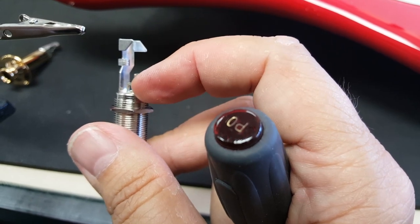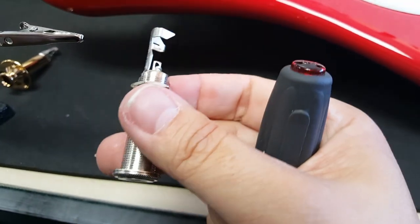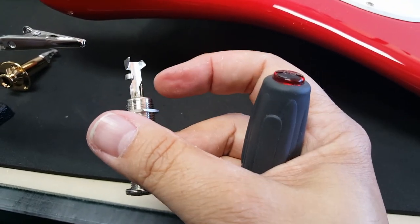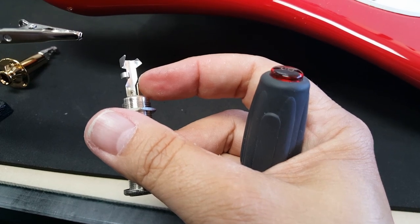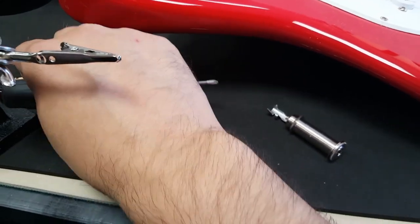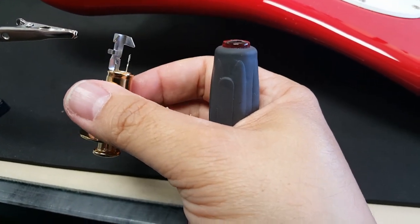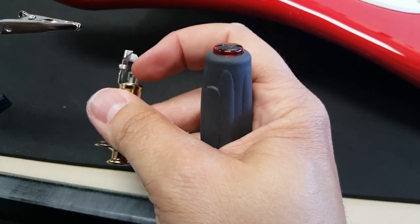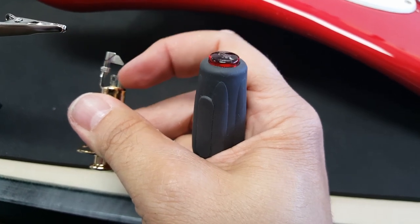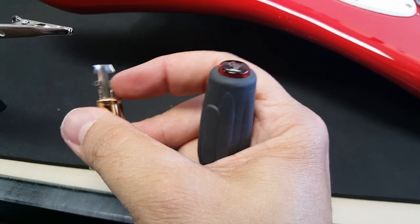The shortest one — that one right there — will be hot. So there's your hot and your ground. If you were installing this in your acoustic or electric guitar, you'd be done. If you had a 9-volt battery, you would attach that 9-volt ground to the third terminal, which is in between the longest and the shortest. What about one like this? This one's definitely for an acoustic guitar, but same thing. The tallest one is the ground and the shortest one is going to be the hot — it'll always be that way. So attach your ground wire here, your hot wire to this one, and if you have a 9-volt battery, attach that ground wire to the middle one.